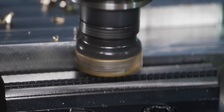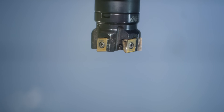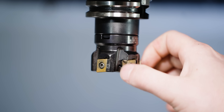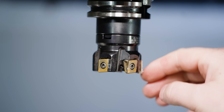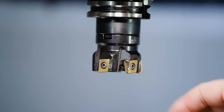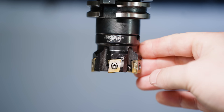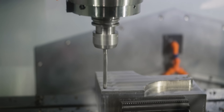We just got done with our heavy roughing operation. The inserts still look pretty good — I do see a little bit of chipping there, but that could be because we're only running air and not coolant. Running through-spindle cooling, if you can, is going to help get these chips out of the way, especially when going up against that shoulder the deeper you go. So now I'm going to drill a series of holes and mill some slots. This is going to lead into our next benefit of why you would use a tangential tool over a regular shoulder mill: interrupted cuts.